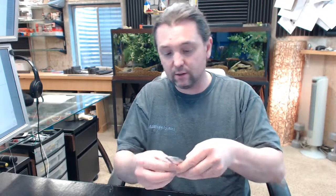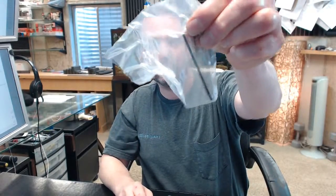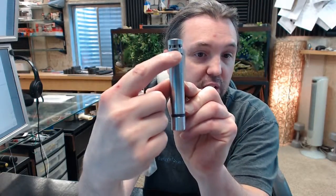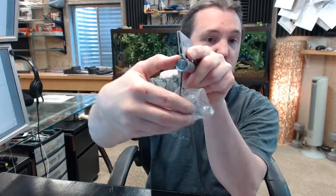Now, with every hinge that you buy, you're certainly going to get a tension pin. That's that little piece of steel that's there. And you'll also, with every order, get at least one tension rod. Now, what happens is when you install this, you will install it so that the tension collar, which is this piece of material here, is pointed towards the top. You'll insert your tension pin into the collar and turn it clockwise. And as you do so, as you can see, you reveal new additional holes. It's into one of those new holes, and don't exceed 3, that you'll insert the tension pin.